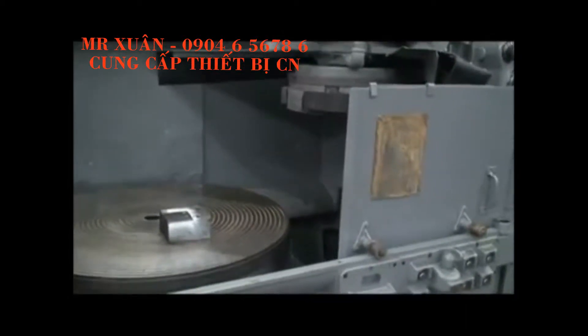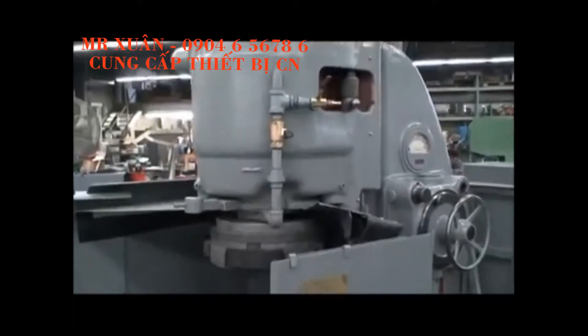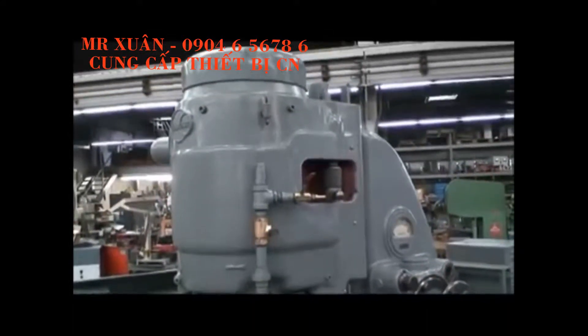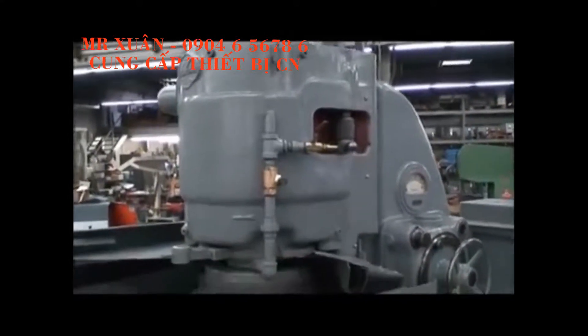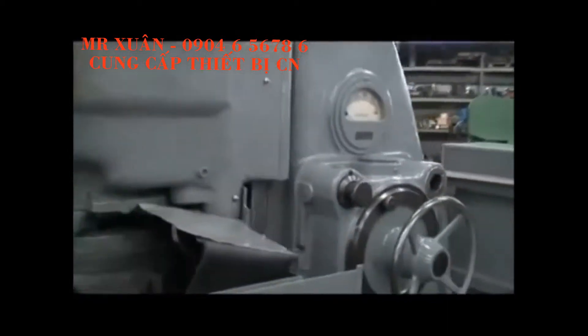On this machine we ended up having to rewind the motor — it's a brand new rewind motor — and at the same time we put new spindle bearings in. That is ready to go. While we had the head off, we had the vertical ways re-scraped.